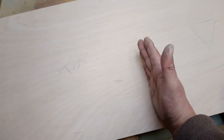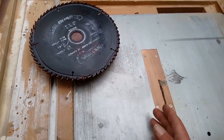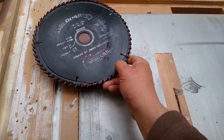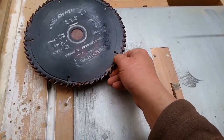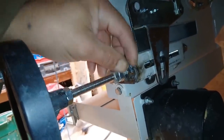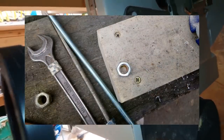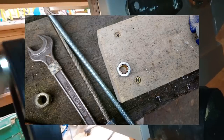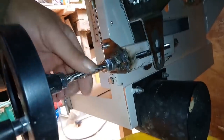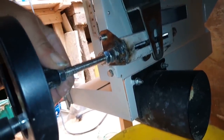I'm going to put this fine tooth blade in. You just want to pull this stuff off - you can just put it in and put a piece of wood through and it'll rip it all off, but just be careful because there will be sharp bits underneath. I welded a couple of nuts on the end and put sleeve anchor pieces inside, using them as packers. Works a lot better. This is still a little bit long, needs a bracket or something to stop it wobbling around.